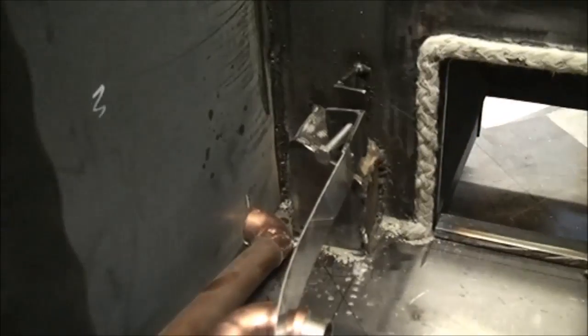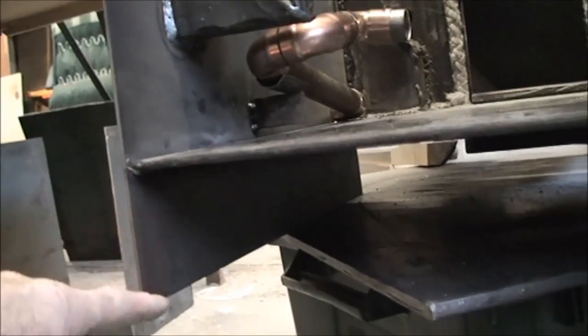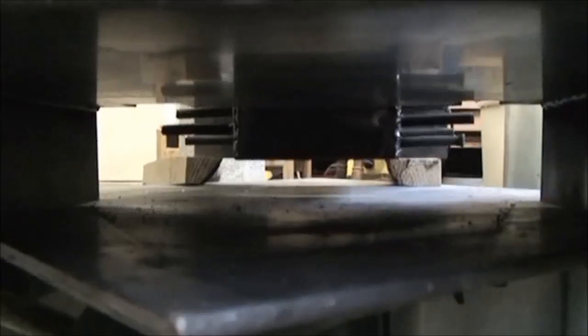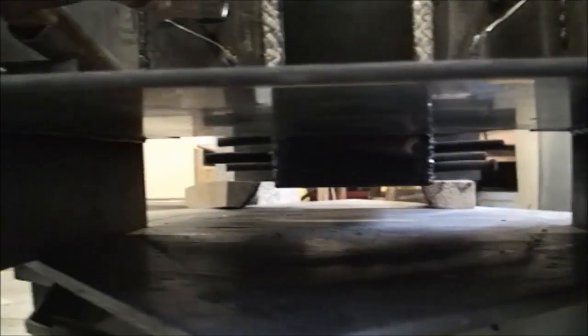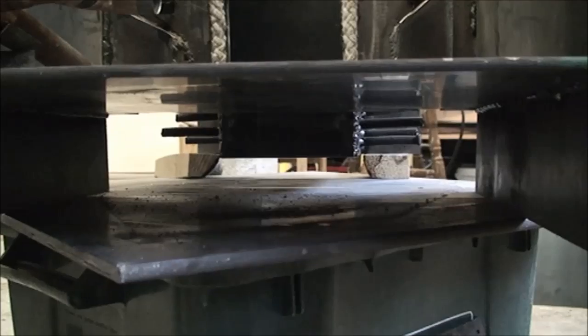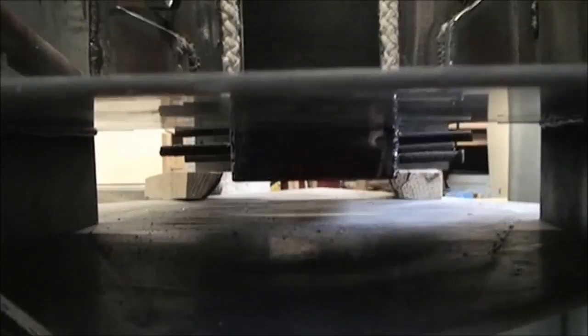You know the two little extra air intake things I put in there — them two little shrouds to allow more air into the system — I just wasted my time completely. Because it just occurred to me that if I put an extra inch and a half on this, then there will actually be an inch and a half underneath the firebox. If you look at the air that can get in under that firebox, there's more than enough area — the riser tube isn't going to be starved of air.